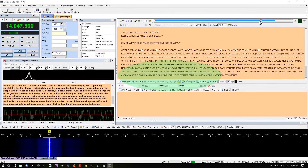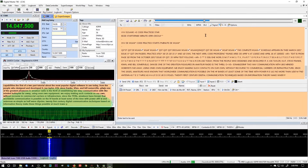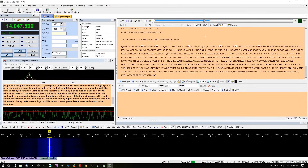What I've found doing this is adjusting the filter — if I jump over and start decoding another station, adjusting the filter anywhere between 50 and 160 hertz, and then adjusting the squelch, I can usually pull the stations in. If they've got a strong signal and their fist is pretty good and they're sending good CW, it will usually decode it. On the ICOM 7300, I'm using filter 3 and it's set to 250 hertz. I do have noise reduction on. The copy on both is really good right now.